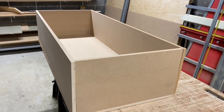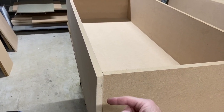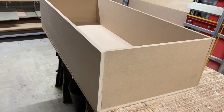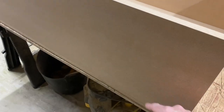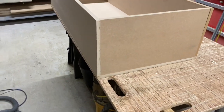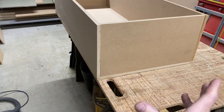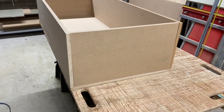There are a few different methods of fixing the carcass. Normally I would just pocket screw the top and bottom into the sides, then screw the back through into the edge of the carcass. But I'm going to try something different: I'll still pocket screw the top and bottom into the sides, but also pocket screw the sides and tops into the back panel. That's the way Alistair does it - you get everything flush at the front, line it up, then screw back down into the back panel.